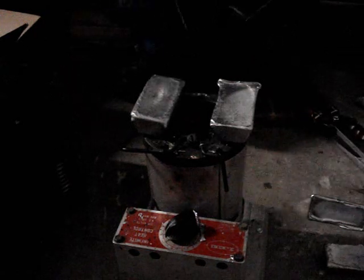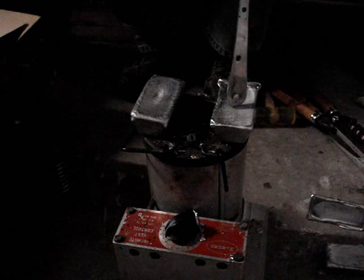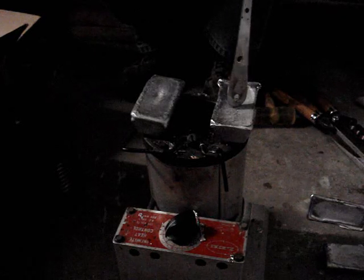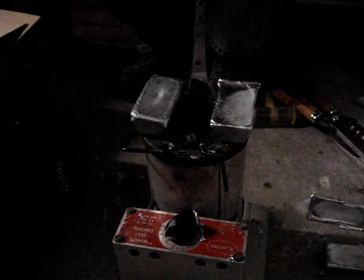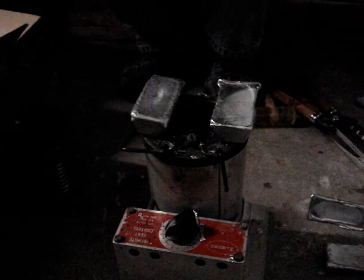What this will do, especially in the wintertime, is that these things can collect moisture, just like if you were to bring in a cold piece of metal from the outside. The moisture can condense on there. If you dropped it straight into the melting pot here, the water would instantly evaporate so violently that the lead inside would come shooting out all over you. So let those things stay on here for a little bit, just to melt any water off of it.